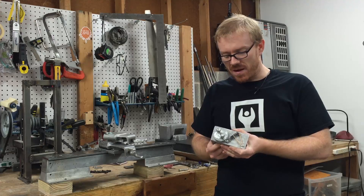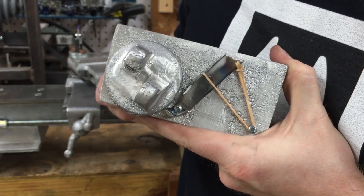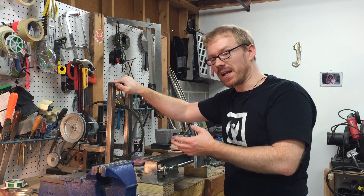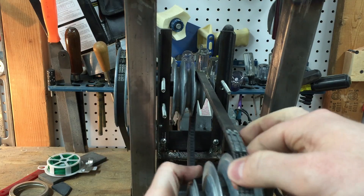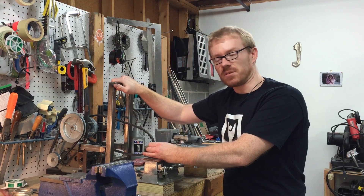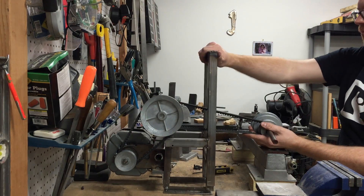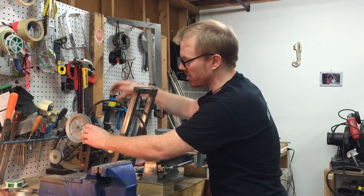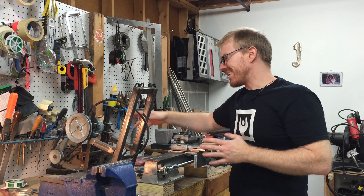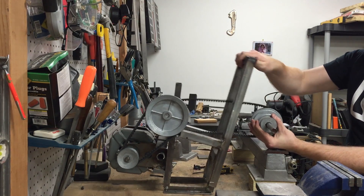I had to fabricate a little detent lever to allow the operator to lock the split nut into an engaged or disengaged position. I also fabricated a mechanism to hold the motor and allow me to relax the tension on the belt for changing the ratio of the step pulleys. I fabricated it pretty much per the plans in the book — it's mostly welded, with the exception of the hinges which are actually pop rivets. There's a large pulley on the intermediary shaft and the motor has a small pulley, which takes it down from something like 1800 RPM on the motor to a spindle speed of approximately 600 RPM.